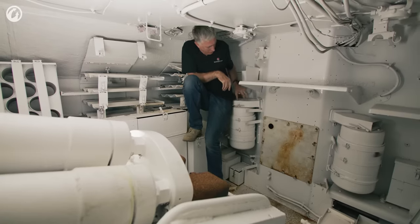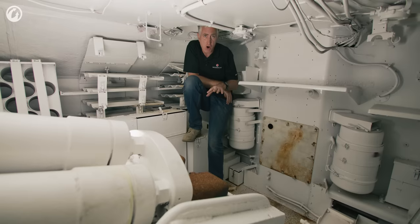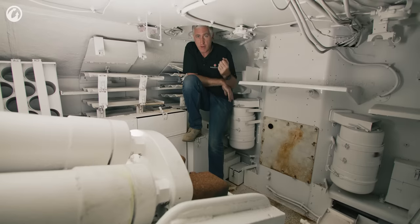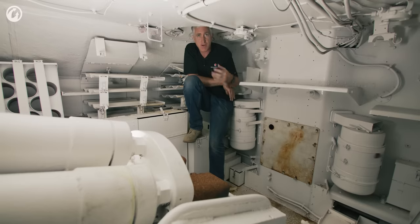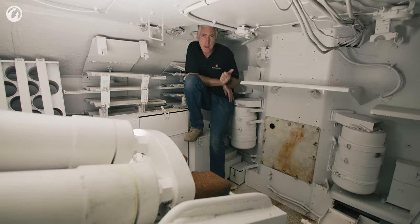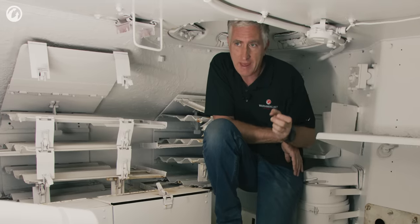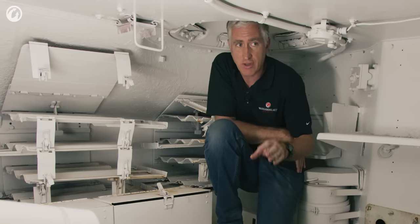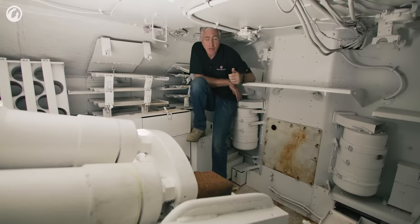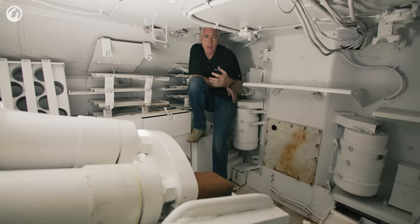the fuel canisters. Now, there are little flaps here, which can open or close depending if you want to draw the air from the crew compartment or from the engine deck. Now, ordinarily, you want to go with the engine deck, not least also if it's winter. You don't want to have the rush of air coming through here as the big engine is sucking in air for combustion. But it is an option if it's A, really, really hot, or B, if the fumes from the firing of the cannon are such that the blower can't keep up. Now, there is a blower, or at least it would be. It's mounted up in the top left. It's actually designed to have a slight overpressure to keep the gases out of the compartment instead of allowing it to come back in.